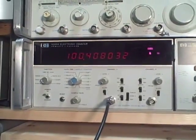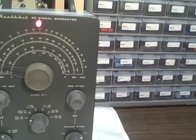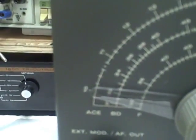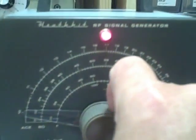What I'm doing right now is I've got the unit connected up to this Hewlett-Packard 5345A and we're measuring the frequency. We had to turn the light off to make it easier. Right now we are on band A, which is supposed to go from 100 kilocycles to 320 kilocycles on the outer ring. Right now I'm set for 100 kilocycles dead-on.